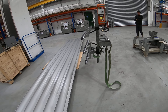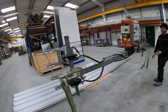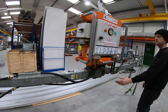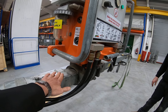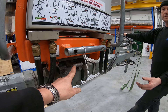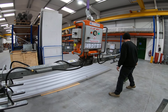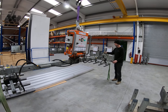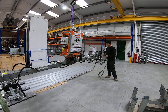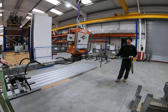First thing we do is rotate the pads so we can actually drop the machine onto the panel. The pivot bar along underneath the machine can actually rotate, and there's a rotation lock. Take the weight on the bar, lift the rotation lock, and the machine will rotate back around. Now the suction pads are facing down, and we're ready to move the machine across to the panel and place it on the panel surface.